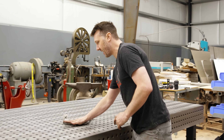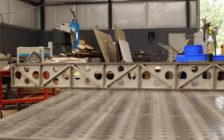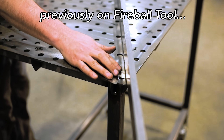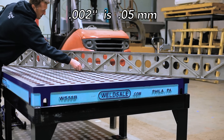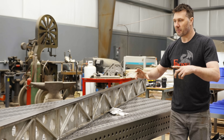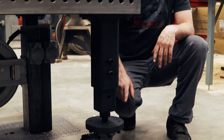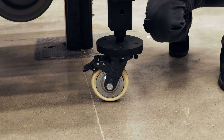Let's give the table a quick wipe down and throw the straight edge on top to see how flat it is. I'm going to run this test exactly the way I did in the table review so we can compare it to the others I tested earlier. Remember, the gold standard for aerospace is two thousandths of an inch in a two-by-two area — let's see if we can beat that. I'd also like to try to get this table to flex, simulating rolling it on the floor and then going to work — its worst condition — so I'm going to raise all the legs up off the ground.